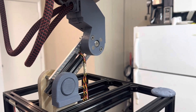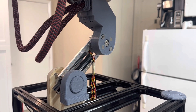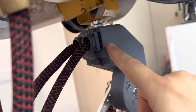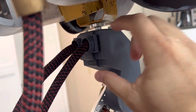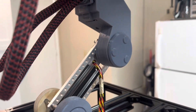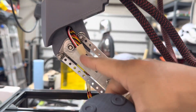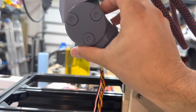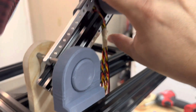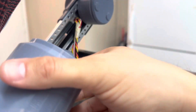Here's another update on the neck mechanism. This is based off of Torsten's neck mechanism — I have modified it for my specific build. You can see the servo wires going into this piece, which is not pushed all the way in yet, but normally it would slide all the way in and get screwed in with four holes. This gets a magnetic cover, and the bottom is exposed right now. The servo wires go through the neck, and there's a piece that gets bolted in here, and another one bolted in here. The wires run down the channel and this piece slides over everything.